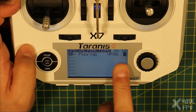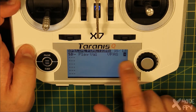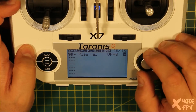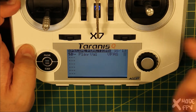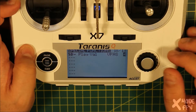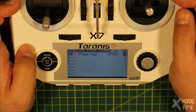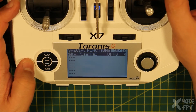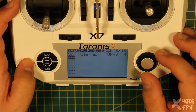This last bit here is the delay between repeats. With a little line like that it won't repeat, but I want it to repeat. So if I leave the switch in this position, I want it to keep reading out the voltage over and over again. So let's set it to four seconds — it will just keep doing that until you stop it. If I switch that away, that'll shut it up.